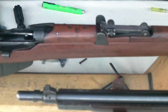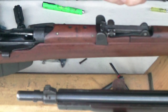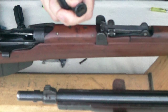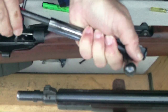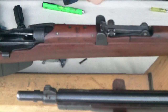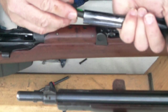Take the spring off and put that to one side. Put the firing pin back into the bolt, then thread it back into the striker knob until it's flush with the end of the striker knob — in the same position as before. There we go, nearly there — and that's it. Tool out, thread the bolt head back in. What we're essentially doing here is reassembling the bolt with the spring taken out.